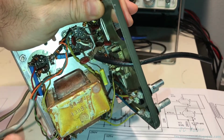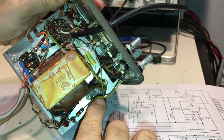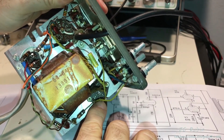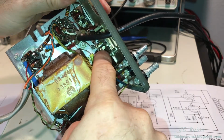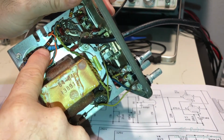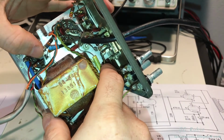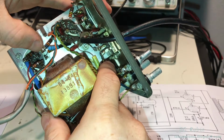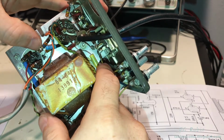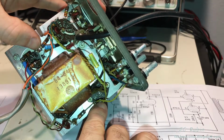This does, however, disconnect the 114 volts to pin 6 of the beam power tube, because it connected from the beam power tube to that switch directly to the capacitor. Even when the switch was off, you could see that was a direct connect, and I've severed that. I'm not sure, because even when the noise switch is open, that connection is still there. I'm not sure if that particular grid required that.